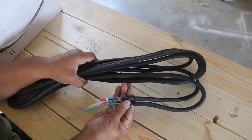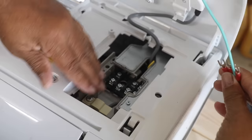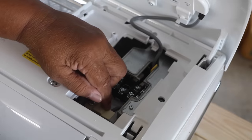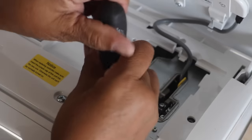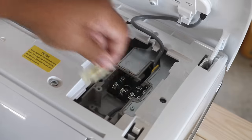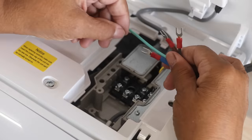What we have here is the signal cable — that's what this looks like. We're going to fish it through the back to the front. This right here is a strain relief, but we're going to need to remove that to give ourselves a little wiggle room. A strain relief holds wires securely so they don't pull out. We'll reinstall that once we fish our wire through. With the strain relief removed, it'll make it easy for us to fish it to the back, to the front, and then make our connections.